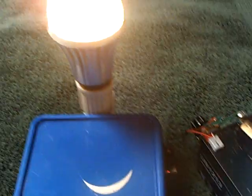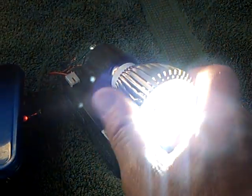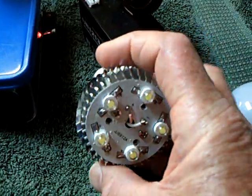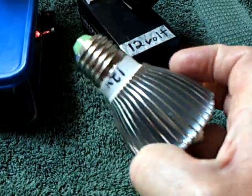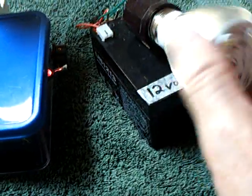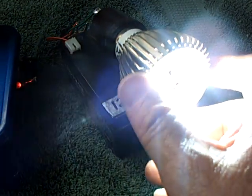I haven't made up my mind on this, but the neat thing about this bulb is I was able to take the lens off and look at it, and those are just one-watt, three-volt LEDs in series, and there's no other circuit in that. That's all there is to that bulb. It works on 12 volts, and actually pretty darn efficient just like that.